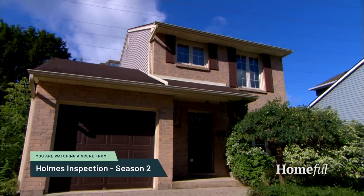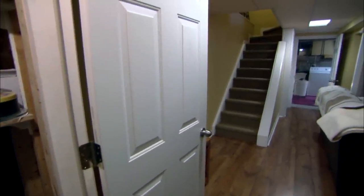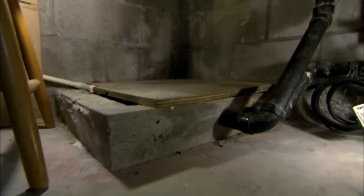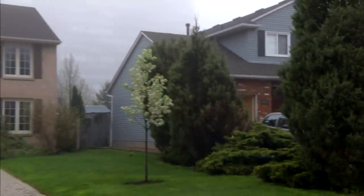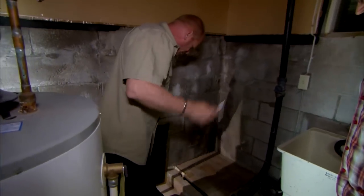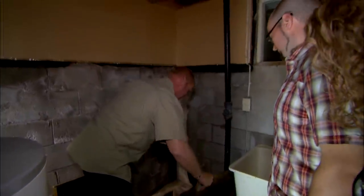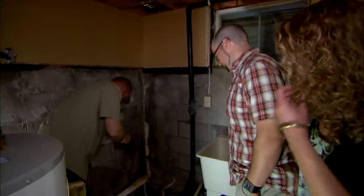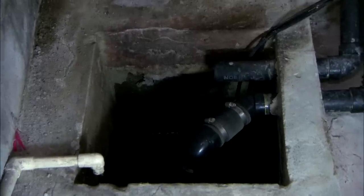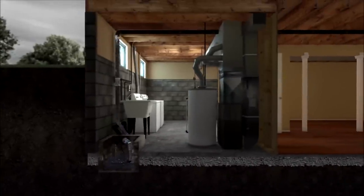The inspector did not give us a written report. He did a walkthrough and pointed out some of the minor problems, and he said there's really nothing to worry about. He pointed out that there were two sump pumps in the house; we couldn't really check to see if they were working, but he just pointed out that they were there. Your home is in a low-lying area, so water will always find its way to your house. We have a sump pump — yes? Because I noticed that we had a drain that went through the wall, and that tells me we're below sewer grade. That's correct. Sump pumps are often used when a home is below the sewer line. In this case, water drains into the pit from the washing machine, the sink, and the floor drain, and the pump then ejects it back up into the main stack where the drain runs into the sewer system.